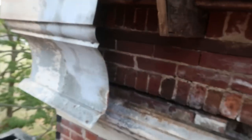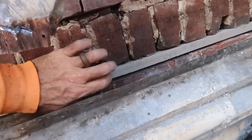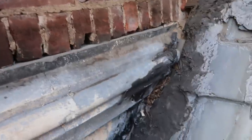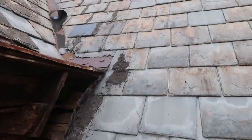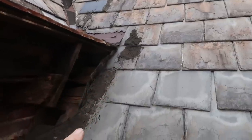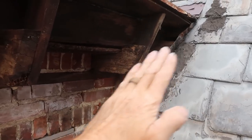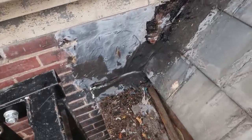Continuing the saga of the box gutter and cornice molding above the maid's room: I put some composite decking in there and hammered it in really good — that's going to be the nailer. Right now I'm going to tackle this area — I'm going to replace from that slate anything with tar on it, and then I'm going to roof up under there and see what we can do.